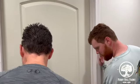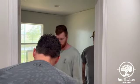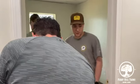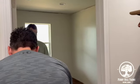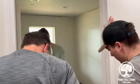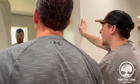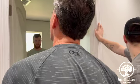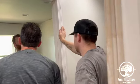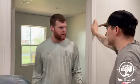It's a little out on this side. Where are your door handles? I don't think we got any for those yet. Put the rest of your screws in, but it's pretty even on the backside. The gap is a little bit smaller down low than it is up top. All you worry about is you hook your latch — it hits that door. You still got to put the plate on here too. It's level, it's good. We're on the right path. Next one.